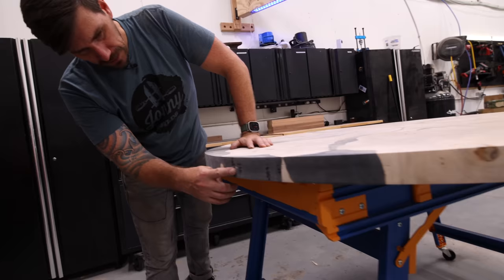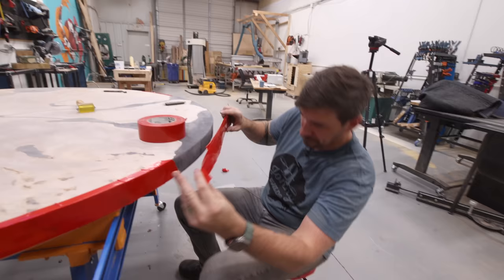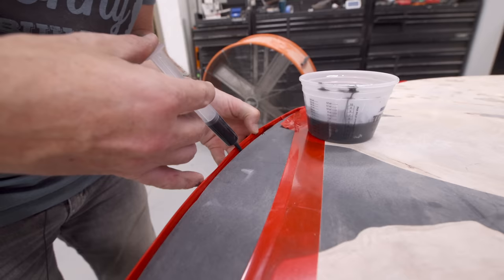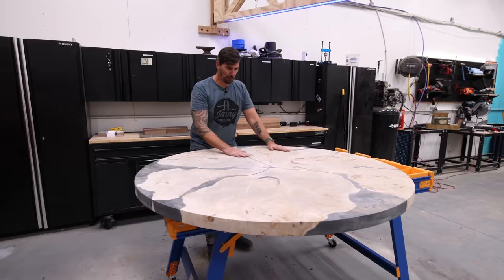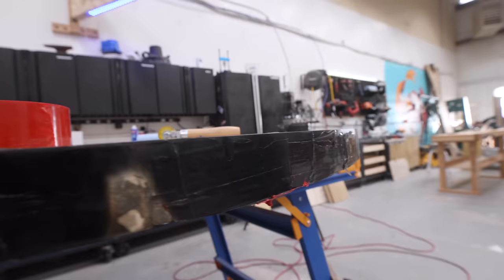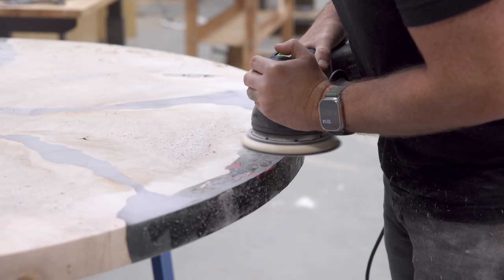The router bit into it in a couple of places because I couldn't go all the way through in one pass — it's all coming back to me now. Filling those gouges on the edge with epoxy works surprisingly well. It took two pours, but I was able to get them filled in to the point where it won't be noticeable in the final piece.